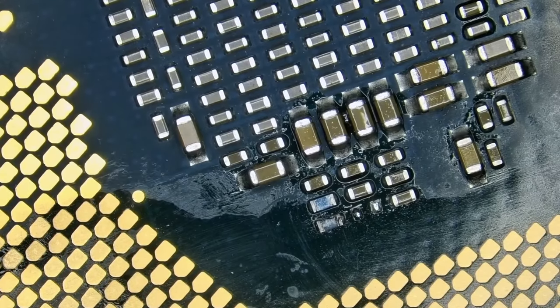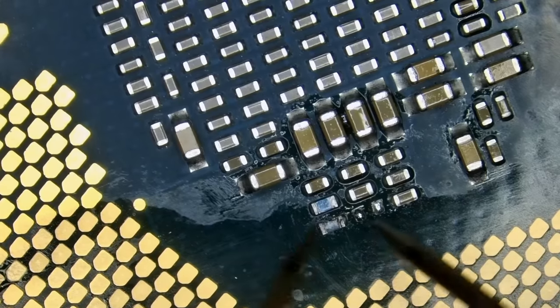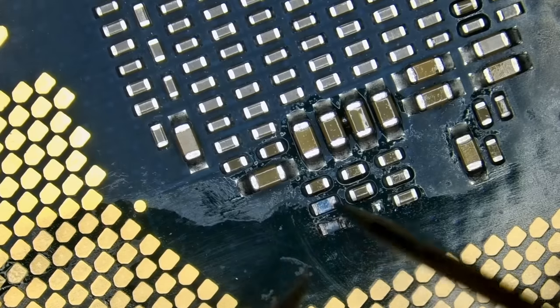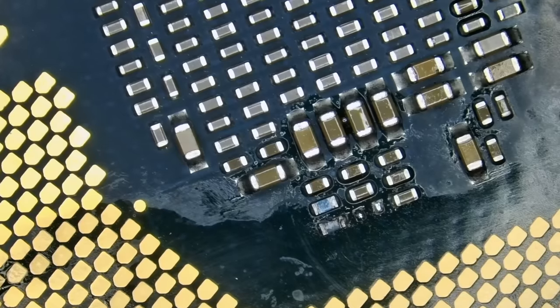And we measured what, 220 ohms? Let me see what readings we get if we measure it in circuit. Same, 220 ohms. So this component is not connecting in parallel with the one next to it. We still have 220 ohms. This information you only get on this channel. Who's gonna tell you that this component is not connected in parallel on the Intel Xeon 8180 28 core 2.5 gigahertz processor? It's not gonna happen.